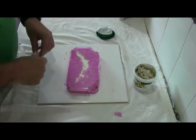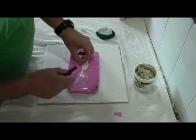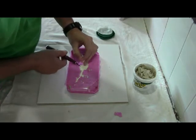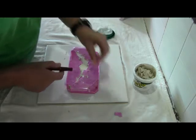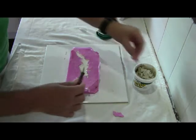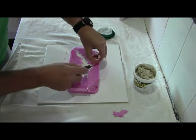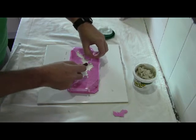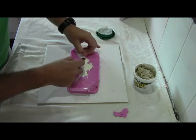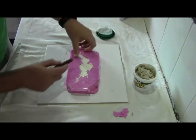One of the things that I like to use just to help trim it and tidy it up is a little scalpel. It's fairly easy. It's just gently trim around the edges, and that cleans it up so that it's a bit easier to use when you're casting your moulds and so on. Keeps it fairly tidy. You can see the effect that it has, even with the putty there. The silicone does find its way in little areas, but as I say, it's no big deal because it's very easy to just gently trim that up and give you a good quality outcome.